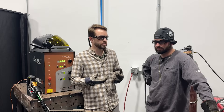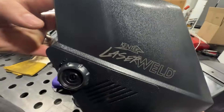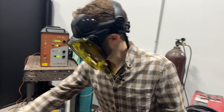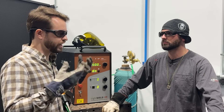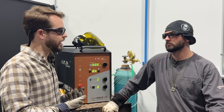When we talk about laser safety glasses we talk about a wavelength and an optical density, or OD. The glasses we're wearing are OD7 — that means they're blocking 99.9999999% of that 1070-nanometer wavelength. Why are there even laser welding hoods when you can just have the glasses on? Best practice is to wear your laser glasses and a hood. If I'm tacking something, it's not very bright and often I'm just wearing my glasses for best visibility, but when welding at higher power for extended periods I always wear a hood. With the laser you can get away with a shade 3 to 5, but if you're not wearing a hood in conjunction with your glasses you will get arc flash over time. I always use both glasses and a hood when welding to keep my eyes safe.